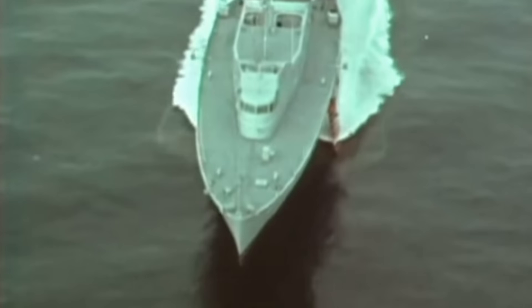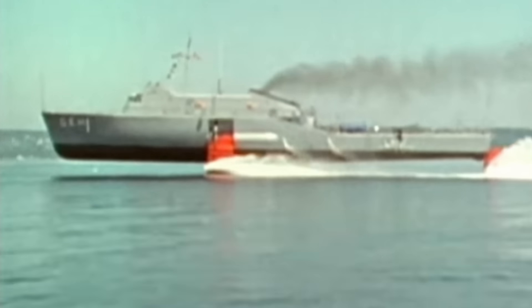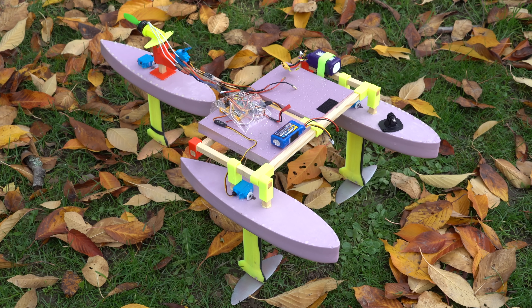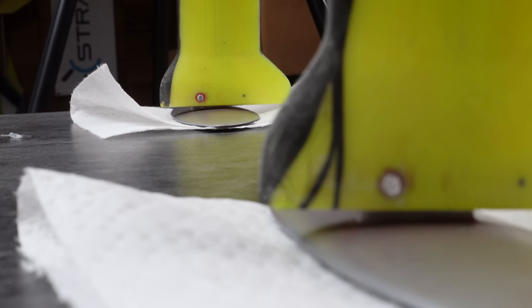The challenge with this design is that it does not have any natural stability, so we need to actively control it to keep it from tipping over. To do this, I'm going to use a drone flight controller to measure the angle of the vessel. The angle of attack of the hydrofoils will be controllable with servos, so the flight controller should be able to stabilize it, just like an airplane. But enough with the theory — let's start building.